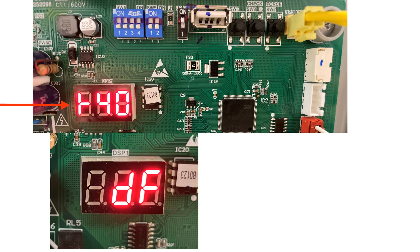You can also use SW2 to check the defrost cycle. After the unit has been running for 10 minutes in heat, press and hold SW2 for 10 seconds. This will put the unit into a manual defrost mode, which will be indicated by a DF appearing on the LED display.